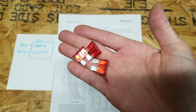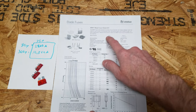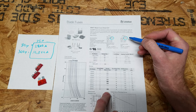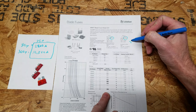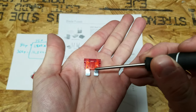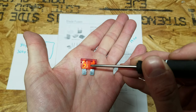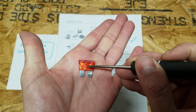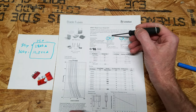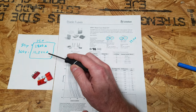The next fuses people commonly use are automotive blade style fuses. The LittleFuse spec sheet shows both mini silver-plated and mini tin-plated versions are rated for 32 volts DC — fine for a 7S pack at 29.4 volts max. These do give an interrupt current rating: 1,000 amps. So if less than 1,000 amps flows, this is guaranteed to break it. At 1,001 amps or 5,000 amps, an arc will form and this could catch fire. For a small pack under 10 cells where short circuit current is below 1,000 amps it's acceptable, but for an 80p or 300p pack, this is not a good choice.